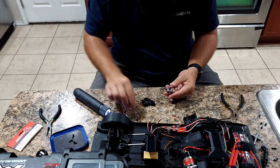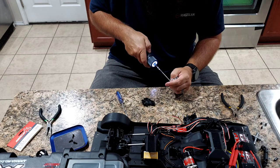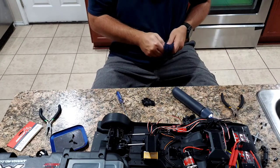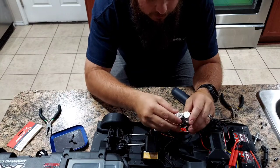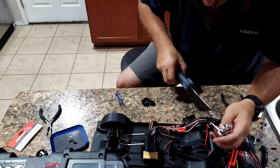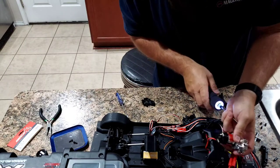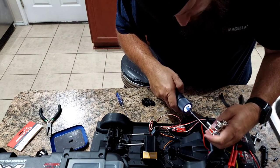Partially because the chrome plating on these sometimes gets in the screw holes, and it doesn't help them thread. Plus they're not pre-threaded, so they've got to make their own threads into the plastic. I recommend using a low-power electric screwdriver - it doesn't over-torque and strip them or damage your plastic. It's a little difficult without one, but it makes the process quicker. I definitely recommend getting one.